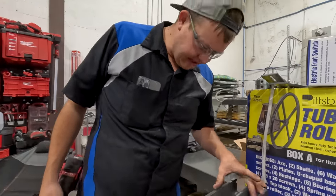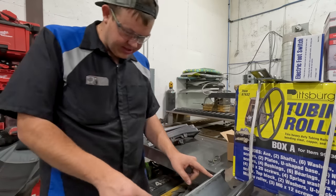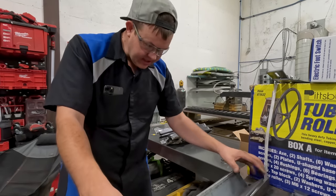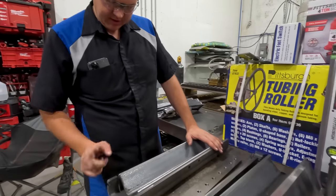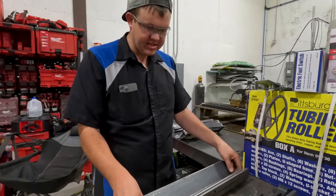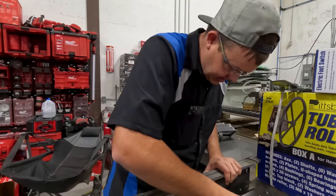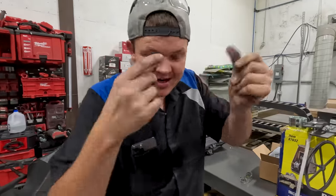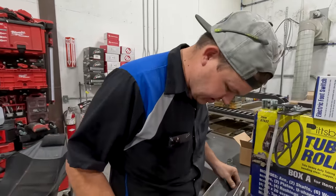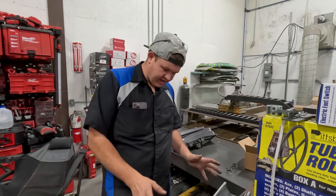So I've taken the mill scale off of both of these edges. Grind up my angles so that when I go to weld this, it's clean. I'm going to hurry and clean up the other ones just like it. I do know I've got a weld in here, so I'm gonna clean those edges up. I just wanna do some prep so that when I go to weld it, it makes it better. All right, and just like that, got these all ground as much as I want. This is just gonna help ensure that everything that we weld is gonna be clean.